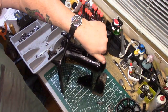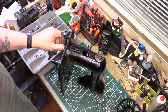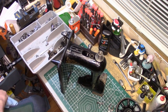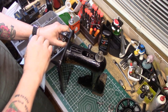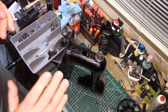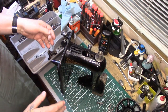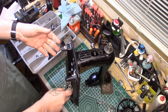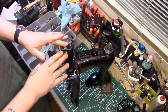We're back with this 99. Earlier today I was chatting with my good friend Patty down in Florida, and while we're talking on the phone I was just aimlessly starting to put this machine together and I realized I'm supposed to be doing this on camera. I'll confess I had the stitch length regulator mechanism everything back in. I'm going to leave the feed dog rock shaft in — that's two screws, you guys know how to put one of those back in place.